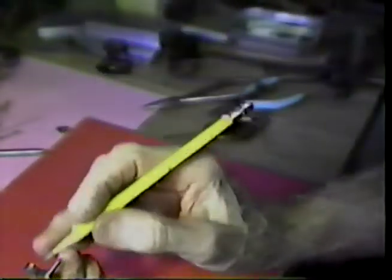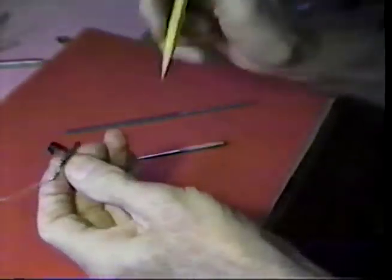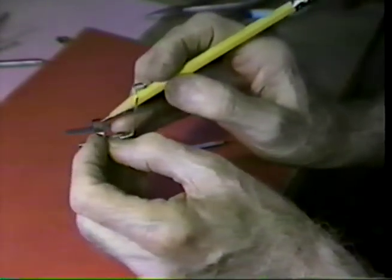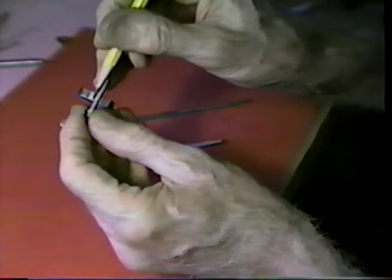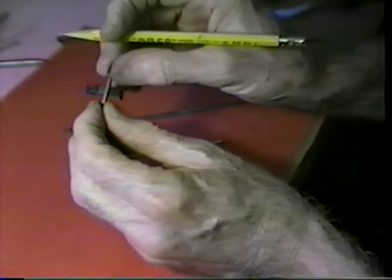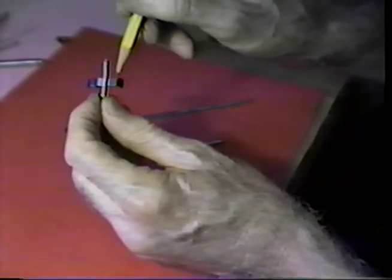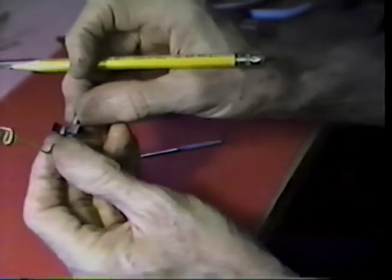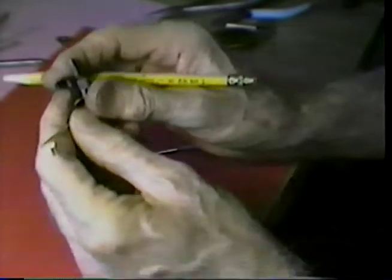Now, if we take a look, this is blue right in this region. Get back into the camera here. This is blue right in this region, and around here it was hotter. It is not blue there. And then there is no discoloration right in the backbone area here. Let's see if we can get a look at that blue right here in the area. Now, if we pick up, the blue begins again right about here and on around here. There is practically no fire scale on this. Discoloration, yes, but practically no fire scale to be seen on this.